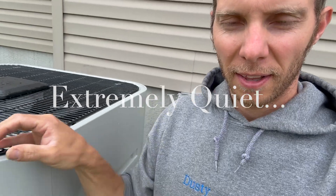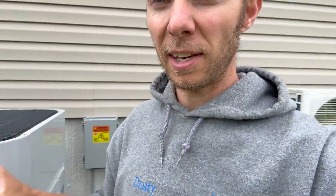One really nice feature of this Bosch is the startup, or initial inrush amperage. These units come on at about one and a half amps compared to the old unit that was in here, which might have had 80 or 90 amps worth of startup amperage. One thing to remember on the new Bosch Ultra: if you don't hook it up communicating with the two-wire, you lose the anti-cold start delay on the heating side. That means when you call for heating with the four-wire or 24-volt hookup, it will bring the fan on right away. They rely on that communicating feature to use the anti-cold start delay in the Ultra. You can hook it up four-wire 24 volts and get the anti-cold start delay on the Plus and the Premium.